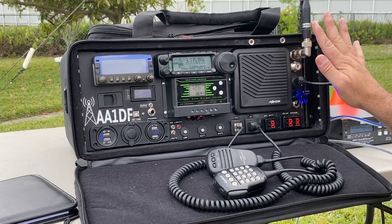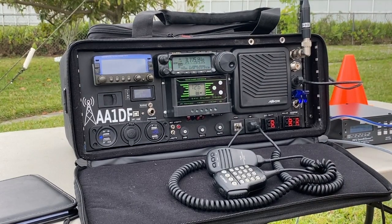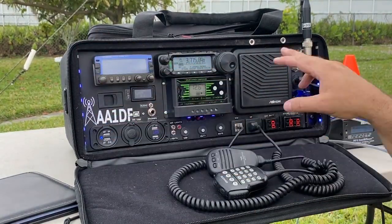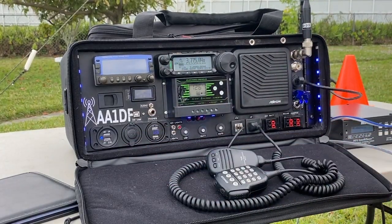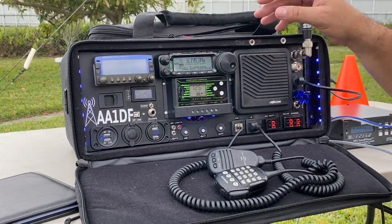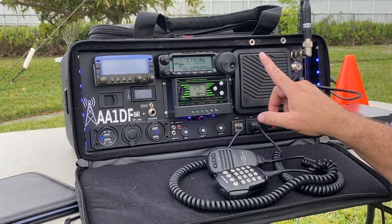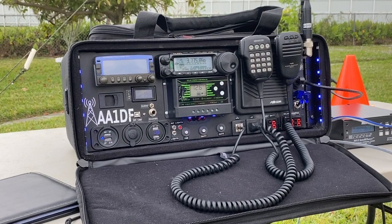I've tested the standing waves on the internal antenna and they're at 1.5:1 across all of VHF and UHF, so it works well. It's a small antenna so coverage isn't great, but it's fine when repeater coverage is good. I also installed LED strip lights for night use — blue lights so they don't mess with your night vision. I carry a small USB gooseneck white light I can plug into the USB port to illuminate my writing pad. Finally, I put magnets at the top of the case and on the backs of the microphones so when not in use, the microphones hang there.